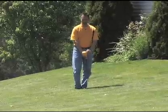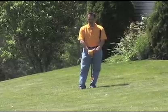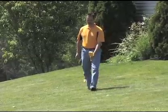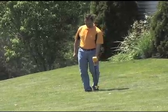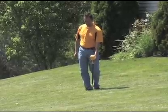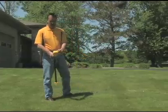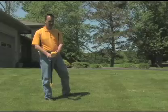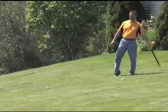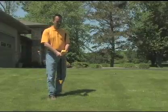I'll turn it down a bit. If I want to use my headset, the only difference is that the sound comes through the earpieces instead of the receiver's speaker. Now I'm going to track it. As I hear that null, when I point directly at the cable, that's where the cable is located — a little to the right, a little to the left. That's why I personally like the null mode. You can switch it to peak mode and hear the difference: as I go over the cable, it gets louder; as I go to the left or right, it fades out. I prefer null, so I'm going back to null.